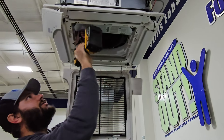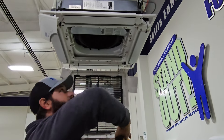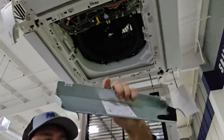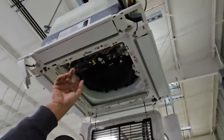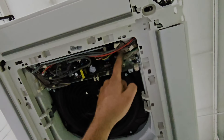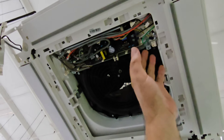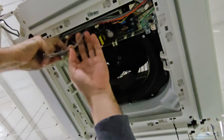There are two Phillips screws on the control board cover. We just took those screws loose, and we're going to pop this cover off. Now that we've got the cover off, we can see our control board. Over here we've got L1 and L2, and over here we've got our communication cables. We've got to take our wires from our fascia panel and disconnect them from the board.